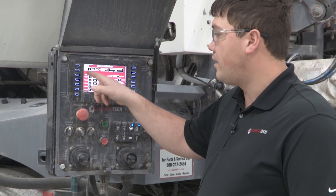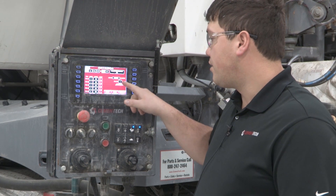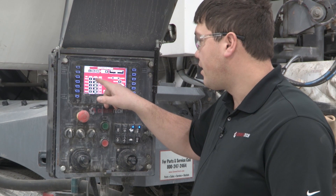We want to make sure that our units of measure are in ounces and that we're calibrating per minute. Then our trial rate — we want to use 75% for the pump speed — and then we'll start calibrating.